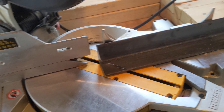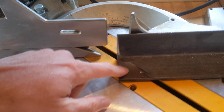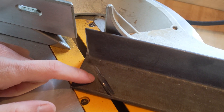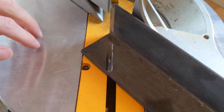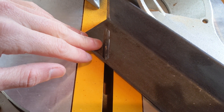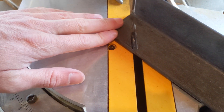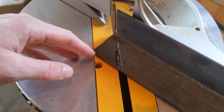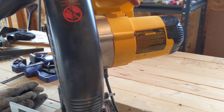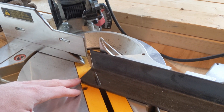So the verdict on this blade we got on here is no good. The cut that it made — you can see it's doing a good job, making a nice straight cut, which is what I wanted. But it's a lot wider than what we need — we only need a very thin cut through this — and it's heating up the metal a lot, which we knew to expect. There's potential it could be heating up the actual saw and the motor since the motor's not really designed for metal cutting, and there's a lot of extra friction and heat going on.